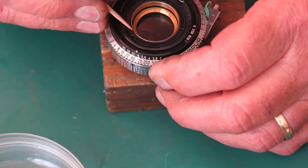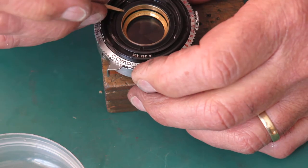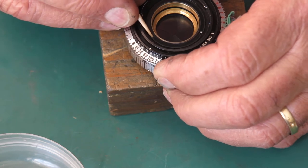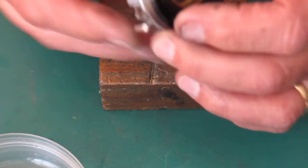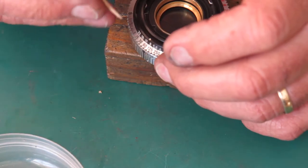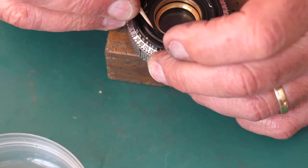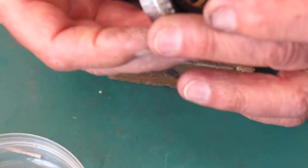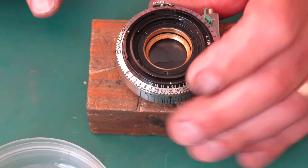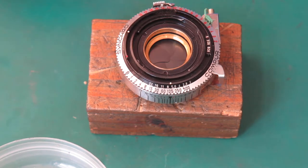And normally you're fitting a little screw in here to lock the settings. So in this case I probably would have picked it up on that spot, or I would have gone back one further notch, loosened it one further notch and gone to there and check this again. It should be a positive click stop, but it shouldn't be over stiff. Because we haven't got the screw, I'm just going to back that up even slightly more again, and I'm going to put three dots of lacquer there to hold that so that that ring does not unscrew. My preferred method obviously would be to use the screw, but we do not have a screw. This will do.